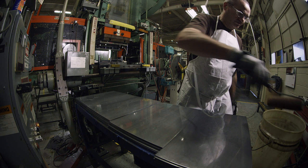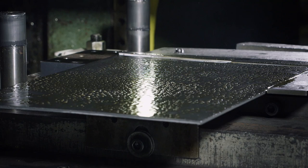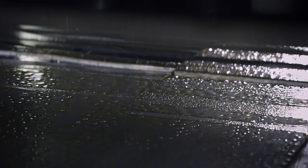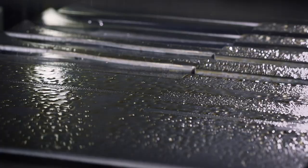The first step in making the knife is to take a sheet of steel called chrome vanadium and coat it with oil so it won't rust. Then the 100-ton press punches out the blade. This kind of metal, used exclusively by Ka-Bar, is flexible and easy to sharpen. The added chrome makes it tough.